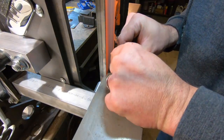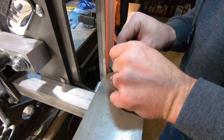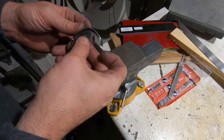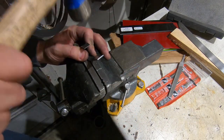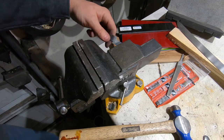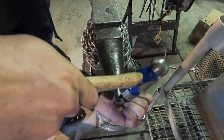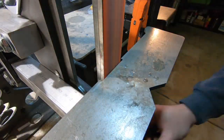Here I'm just smoothing it out into an oval on the grinder, then I'm going to wrap that other piece of metal around it, MIG weld it, and then I should have my kashira. This part's a little finicky and tedious to get this wrapped around tight enough that I can MIG weld it and won't see a seam. I've already MIG welded it now; I'm just taking it to the grinder and taking off all the weld seams.